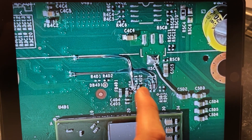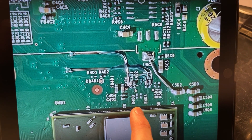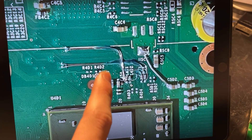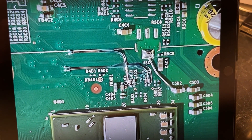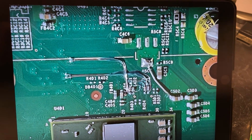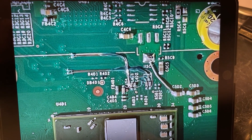The Xenon and Zephyr A have a different layout for the PCIe traces between the GPU and the Southbridge. So this is my version of the Senatorman mod, which is something created by Senatorman in order to attach GPU Rhea to Xenon. However, I put my own little spin on it, and here is my result.